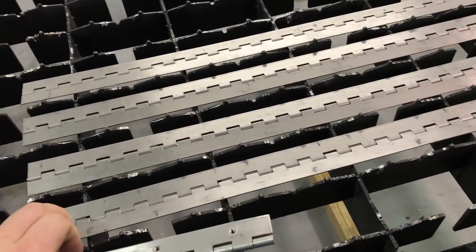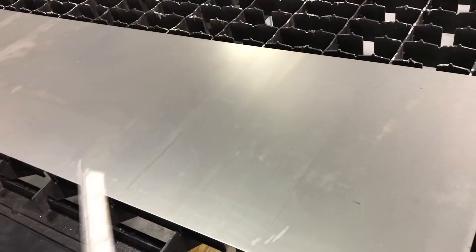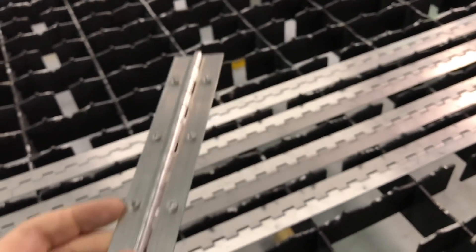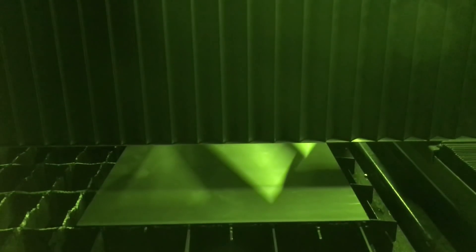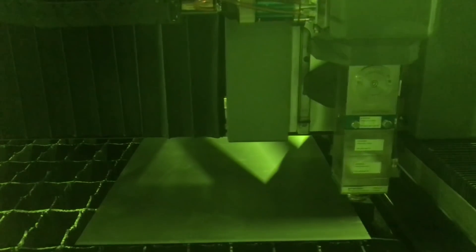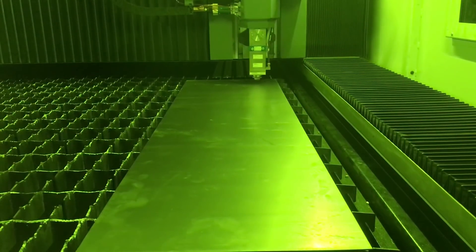Today I'm going to be making large hinges by laser cutting holes in them. First, I'm going to cut a fixture out of this steel plate and cut the holes in the hinges, then press in some hardware. The head is going to come down and measure the sheet, then cut the fixture. This measurement allows for the misalignment of the sheet and adjusts the program accordingly.